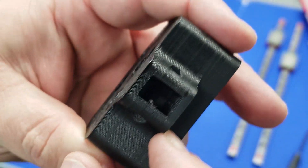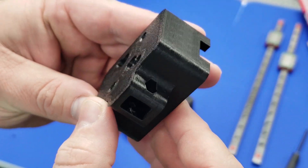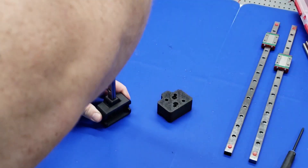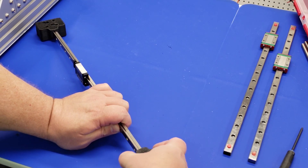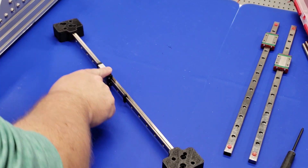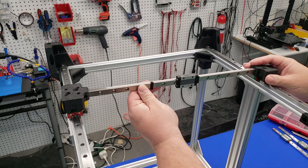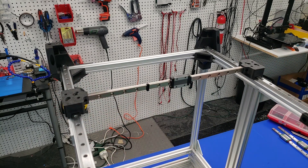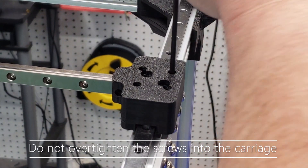The carriage linear rail is pretty straightforward as well. We're going to use two 3D printed parts for the carriage. You'll notice there's a side that has a hole for a nut and the other side is where the screw inserts — you want the nut side facing toward the back, which determines which one goes on the left and which on the right. Once ready, push them into the block on both sides, then install onto the other two rails by gently placing them over the carriage blocks. Secure the 3D print to the carriage blocks using M3 8mm socket head screws.